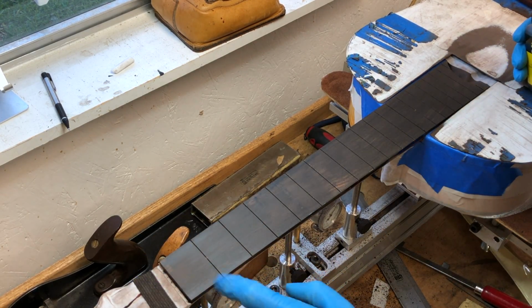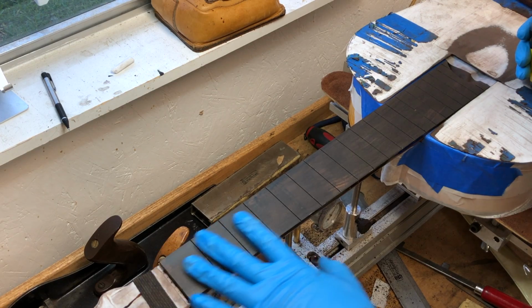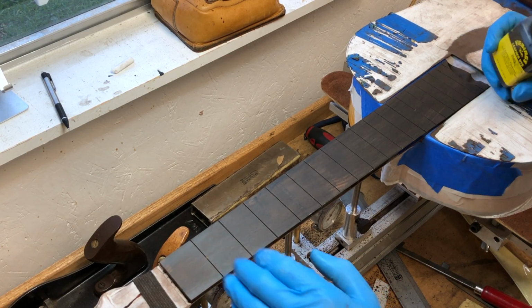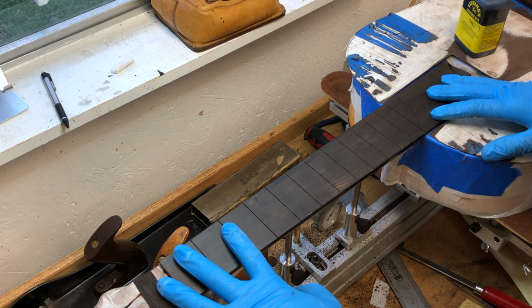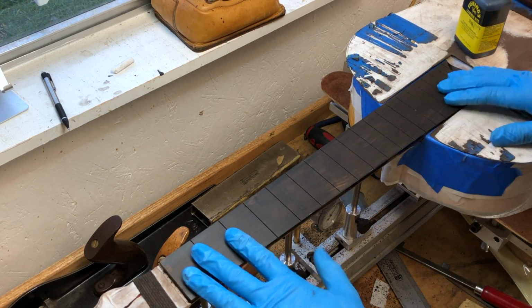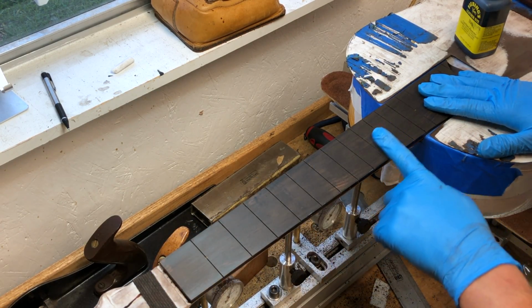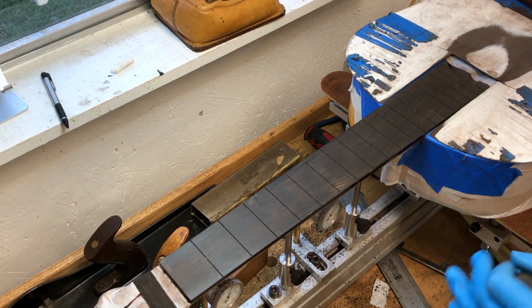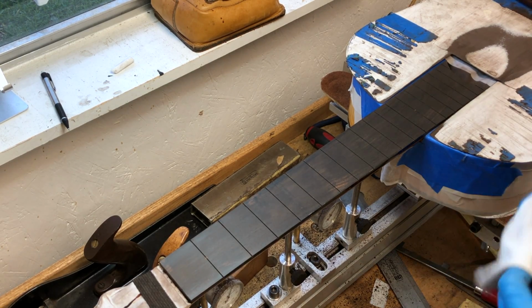Okay, but, so this board, oddly enough, is a very expensive guitar. But the ebony is not the best quality. And it's not because it's not super black, but I mean by that, it was a little bit too chippy. It was a little porous and the grain wasn't really quarter sawn. It was a kind of a wild grain going through there. So we see it's not a uniform color. And I think for this guitar, it should be darker. Sometimes I like to keep the beautiful wood and highlight the irregularities in it because that's where the beauty comes from, but we're gonna do something different here.